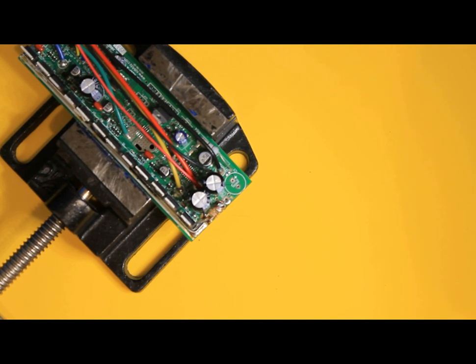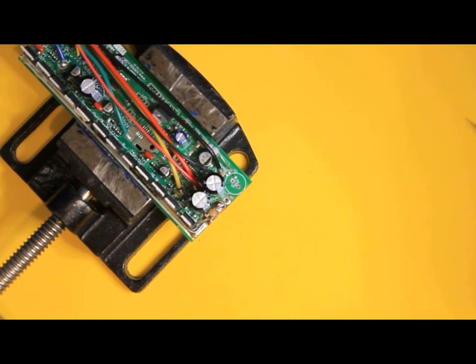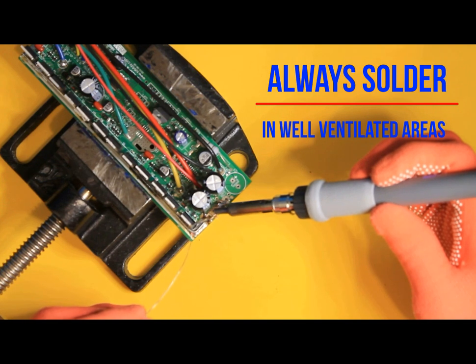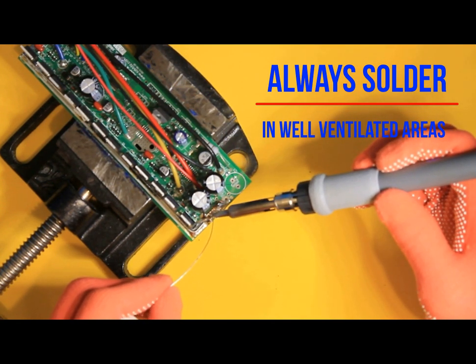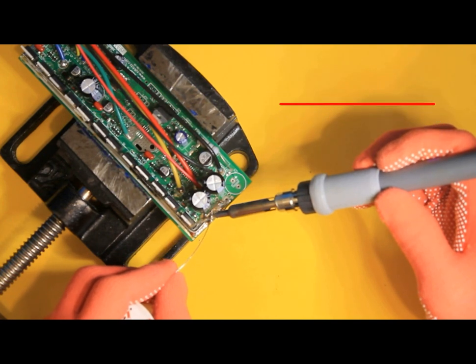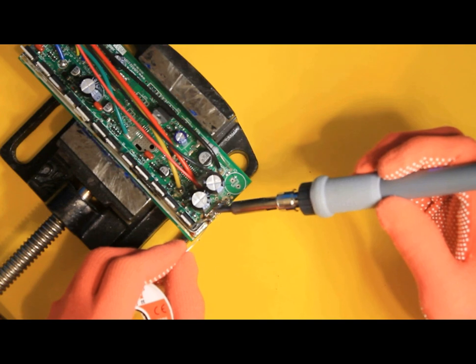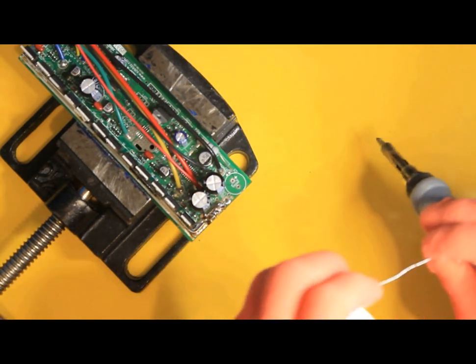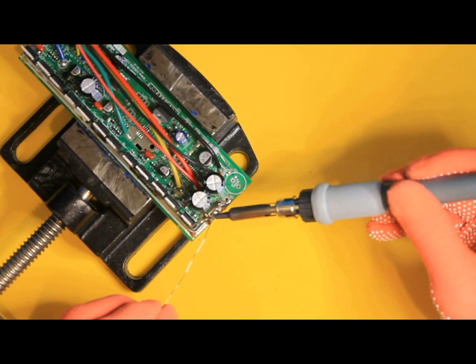Let me check if the solder gun is ready. I'm going to grab some solder and try to cover these two prongs — that's essentially all I want to do. First I'm going to heat up the prongs, then add the solder so it combines and flows on there really well. I didn't want to bend the shunts together, which would have been faster, but there's a real risk of cracking the circuit board and breaking a trace.